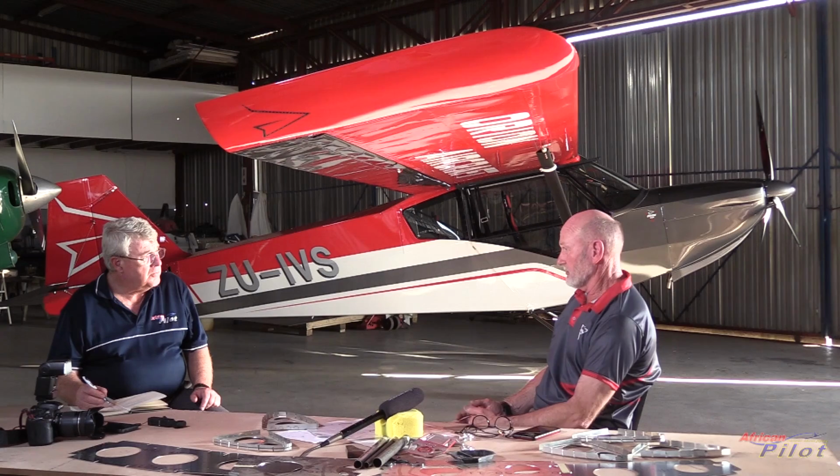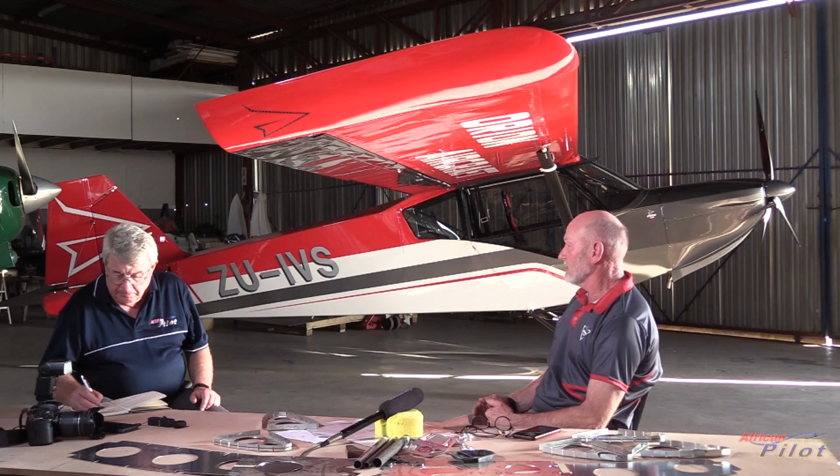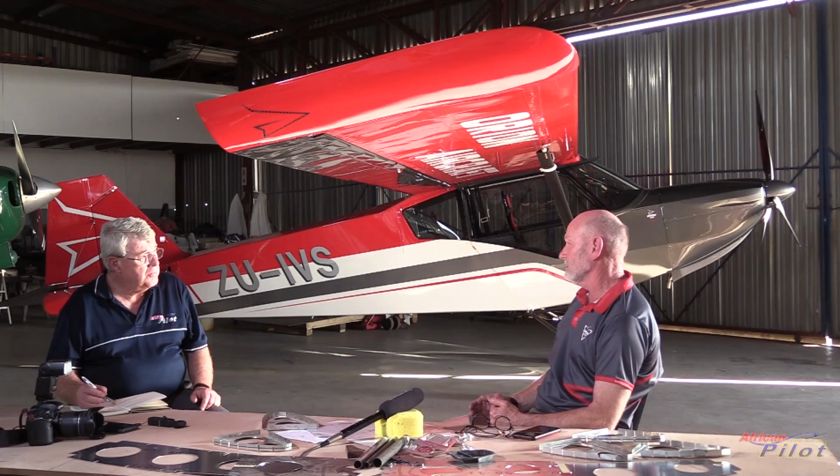It does put our CG a little bit further back than would be normal, but we're using that as our testing phase, so we can very easily accommodate an aft CG, and that's what we've been practicing at the present moment, where we're adding barrels of water until the test pilot comes back and says, please don't add any more. We haven't reached that point, and we've gone back to 22 inches. Our projection is only 19 inches, so even at a 22 inch rear CG, the airplane is still very, very handleable and docile and still has a perfect stall.